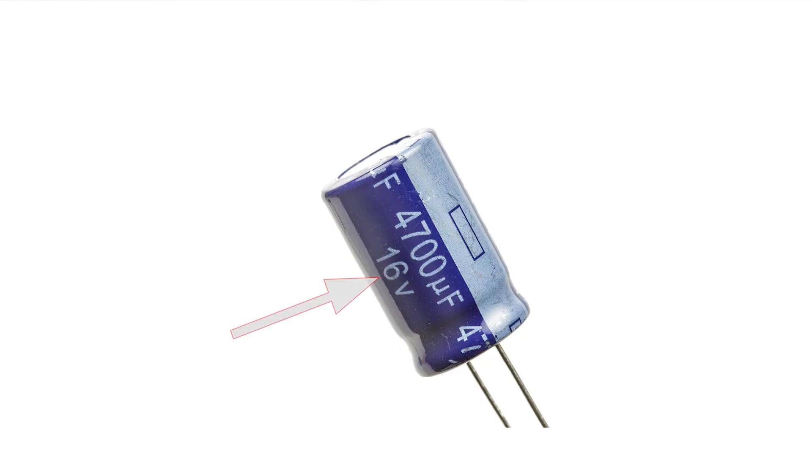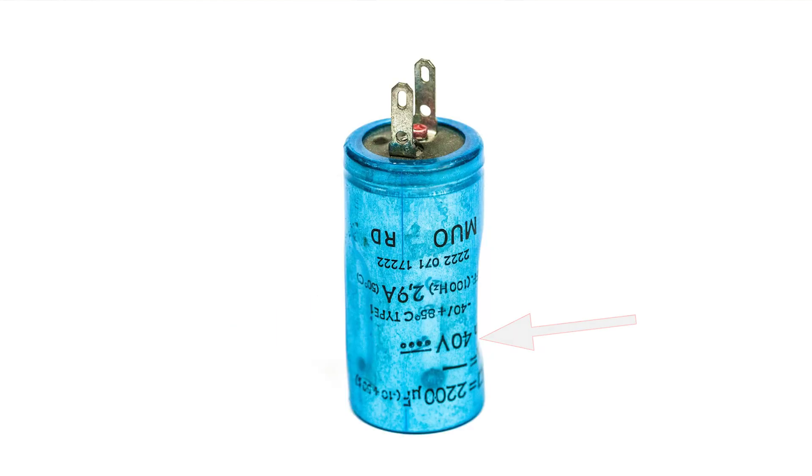Then don't exceed the operating voltage. Electrolytic capacitors, like any other capacitor, don't like the maximum operating voltage being exceeded. This is often written on the outside of the can of the capacitor and also in the datasheet, so stick well within this.